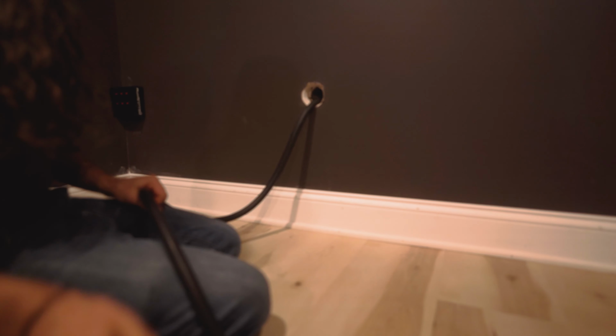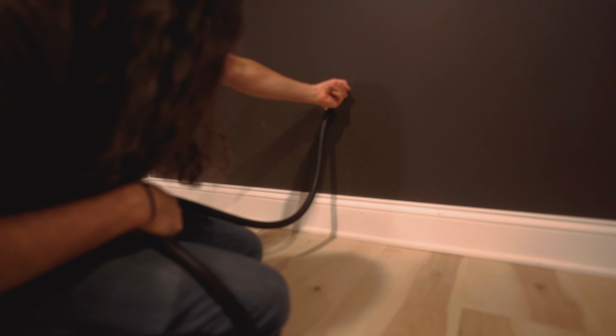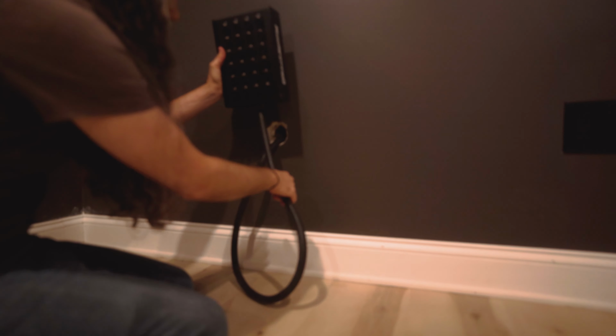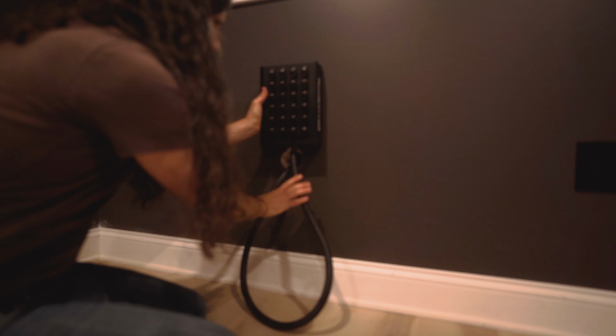But the issue we ran into was that for all my boxes, except for one, the cable is too thick. I thought I was going to be able to tuck it between the walls, but that would have messed with the insulation too much and I couldn't do it. So plan B is I'm going to fill this in as best as I can. More insulation, some foam, some sealant, some spackle, and then mount this up here, and then we'll just tie this neatly up.